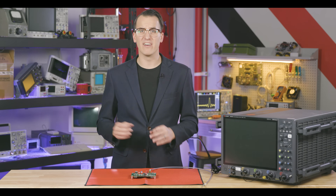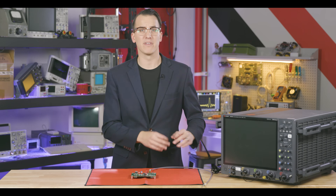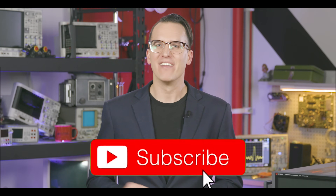Handle boards and cables properly — this means keeping charged materials at least a foot away from your boards, using standoffs, proper materials, and proper discharging techniques. Thanks for watching. Make sure to subscribe to this YouTube channel, download the free ESD checklist, and put your worst ESD story in the comments so we can commiserate with you. I'm Daniel Bogdanoff, and I'll see you next time.